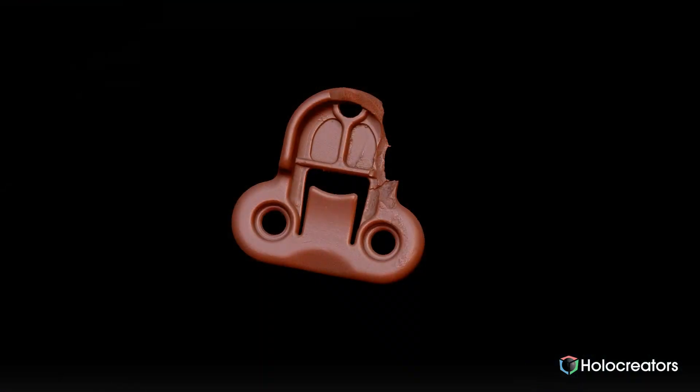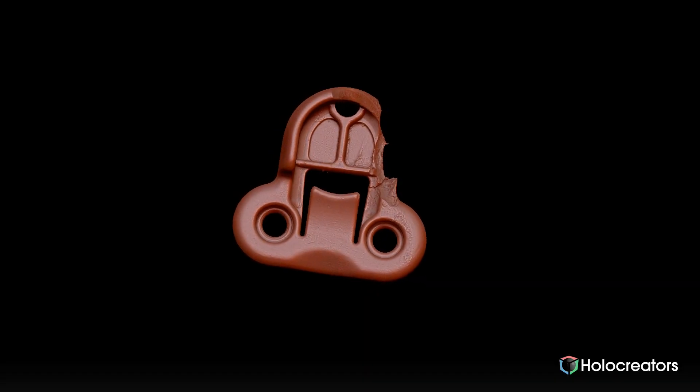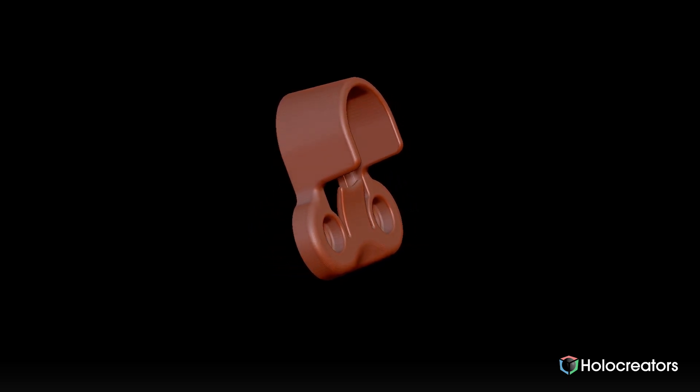The second step is the digital reconstruction — the repairing of the part inside software. This is also called reverse engineering. You take the digital scan of the broken part, load it into the software, use it as a reference, and reconstruct the part. You can see in the render a before-and-after rotating view of the part — that's pretty cool. We completely made a new part which looks absolutely perfect, very precise, and hopefully ready for 3D printing.